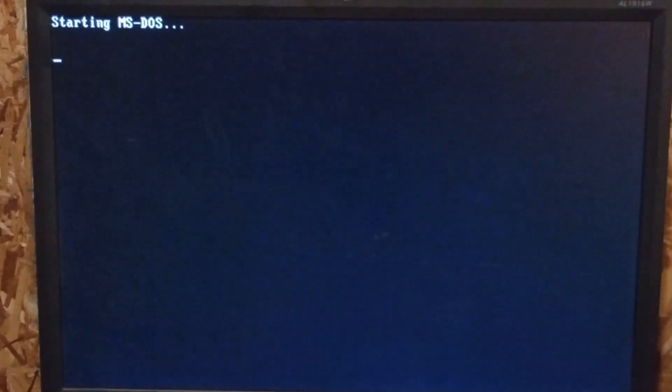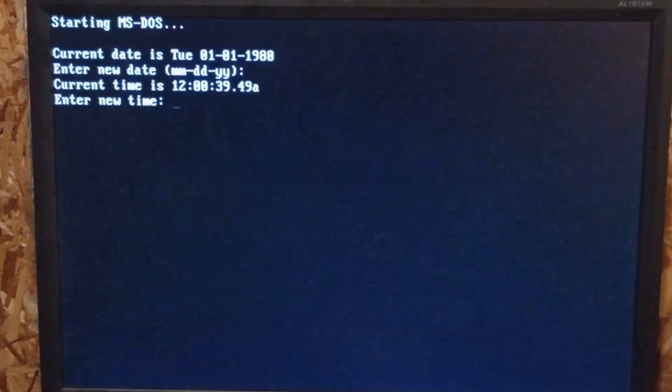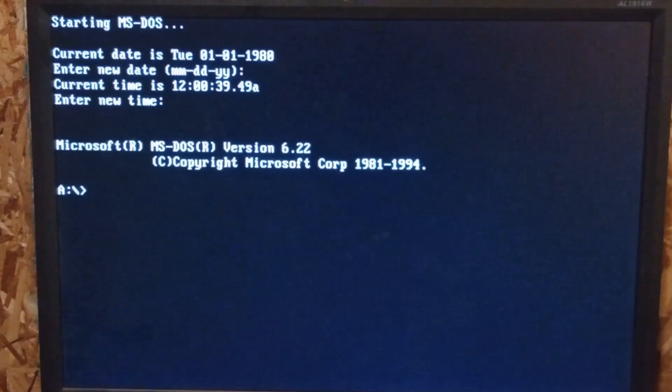So let's see if we get this to boot — booting from the floppy drive. One thing I forgot to do before we changed the whole EEPROM and all that: there was a command called D-format that was in those tools, and I typed that the first time I did this to format the disk-on-chip — it just erased whatever was on there already.